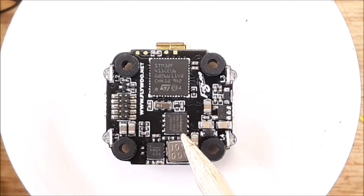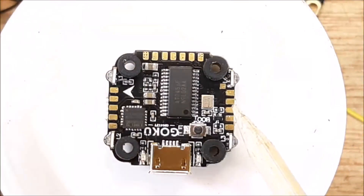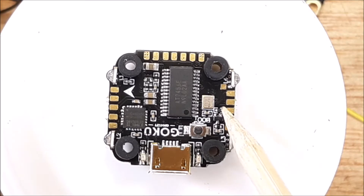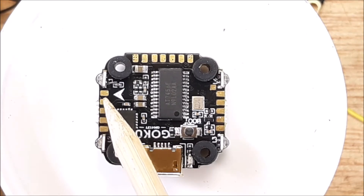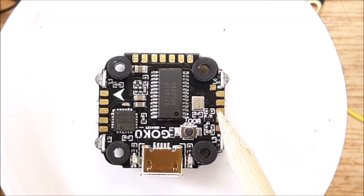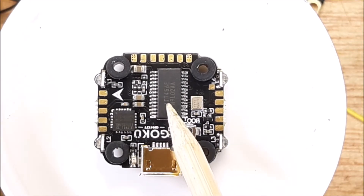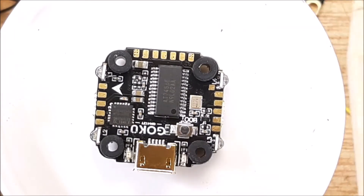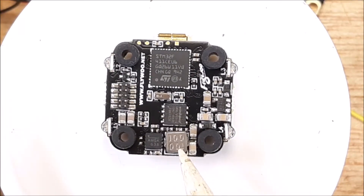It's going to switch your voltage and feed five volts out to the five volt rail. So when you plug in your flight controller, it powers five volts out to different components. One of these pads is five volt out for the camera, one is five volt out for the VTX, and one is for the receiver. Basically, the flight controller is feeding five volts out everywhere.